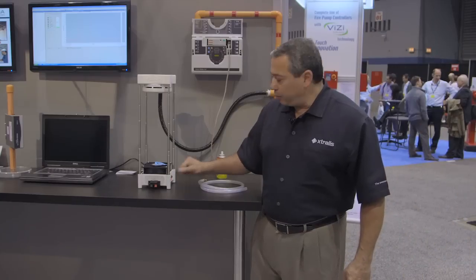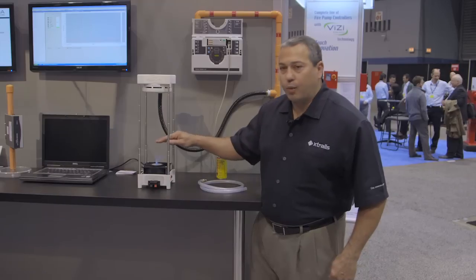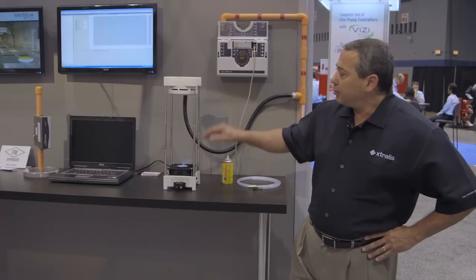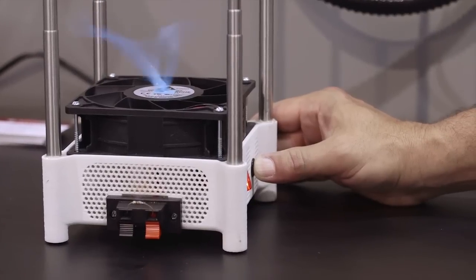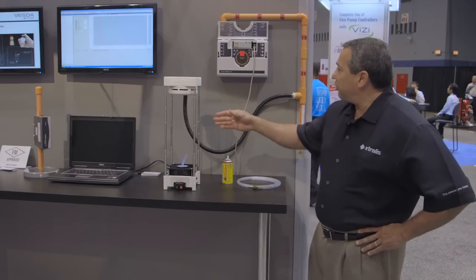To start this test, we'll turn on the fan and generate the airstream. We're going to ramp it up to about 350 CFM. The idea is that when you have a condition such as this — a higher velocity — traditional spot-type detectors subject to higher velocity have a challenge performing. And as you'll see here, smoke is coming off the resistor, and we're watching it perform.